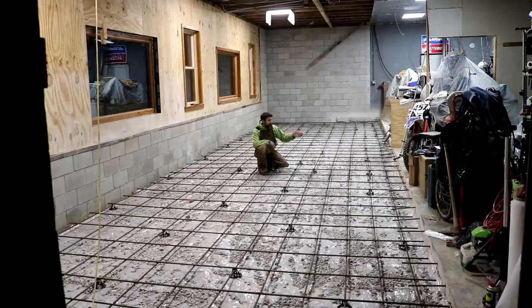Now, what I'm going to do here is just a piece of 1/8-inch sheet metal on that cut line stood up on end at the height that I want this pad to end up at. That way we can just screed to the top of it, and this pad will be nice and level. Then I'll cap that side potentially in the future, when I can. So that's the thought anyway. I haven't dealt with capping a pad, but I know it can be done, so I'm going to have to really look into that and get this done first, move my stuff over, get it all cleaned up, right? I'll be glad when I can do that, and then address that issue. But for now, that's it, I think.